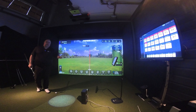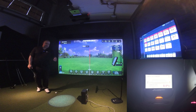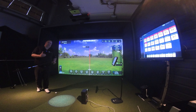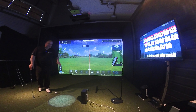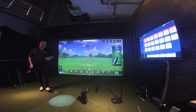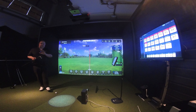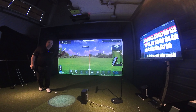We moved the GC3 physically so it was at zero-zero to the alignment rod, and I'll explain why. Once we got the GC3 at zero-zero to the alignment rod, we then laser lined the iMini Lite to the GC3 as best we could. The iMini Lite has a very nice base that gives you a very good straight line to see alignment. The GC3 uses the alignment rod and is quite curved, so it wasn't the easiest, but it was pretty darn close. I think that was the fairest way of aligning those devices up. Unicore is already set to zero-zero in its own software, so those two are as good as it's going to get.